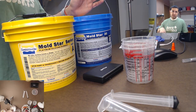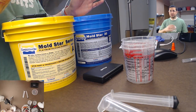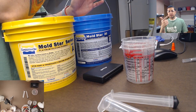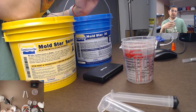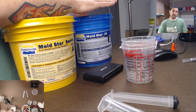And this is a much stronger silicone. This one has like twice the strength of Umu. And it's more viscous. It has a much stronger stretch ability. It's a much harder resin or a harder silicone, so it doesn't take damage that well, which is great because when you're pulling the keycaps in and out of these things and reusing them, you inevitably end up damaging the mold a little bit each time. And this particular silicone can handle that way better.